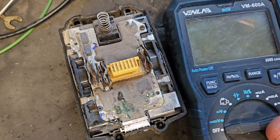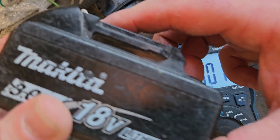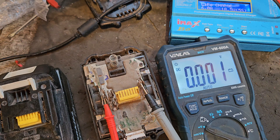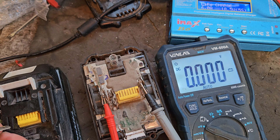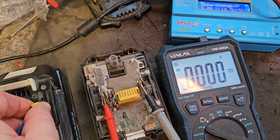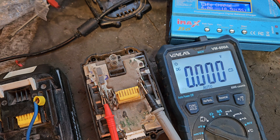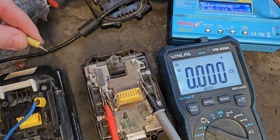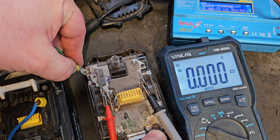So let's do this right. I'm going to monitor the voltage as we jump-start it with this good battery. There are reasons why this is a bad idea — it heats up the cells — but this battery has left us with no option. We're monitoring the voltage, so we're being very safe and careful about the whole thing.